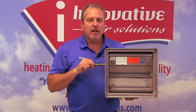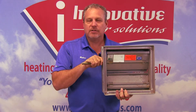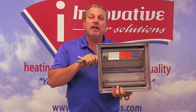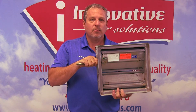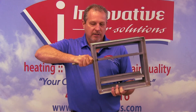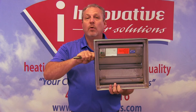This is a very high-end damper. The zone systems we use are very high-end. Systems communicate with the inside unit and the outside unit. High-end zone systems will control the speed of the blower and also control staging of the inside and outside unit so that we don't blow too much air down the duct and cause grill noise, but also makes the units run more efficiently and very, very quiet. This damper is simply a mechanical device put inside the duct to open and close to allow airflow where we want it when we need it.